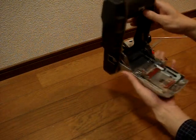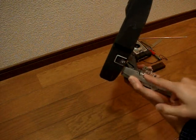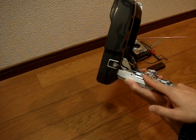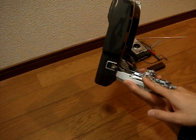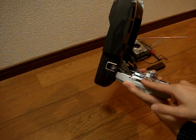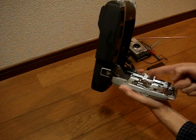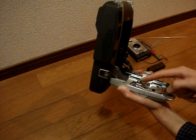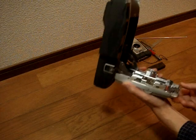Before we get into the actual block, the holes where the pivot pin was mounted before were four millimeters in diameter. I decided to shim these up with a section of brass pipe to make two bushings. The inner diameter is three millimeters, outer four, so they fit in there nicely and they now provide a three millimeter diameter hole.